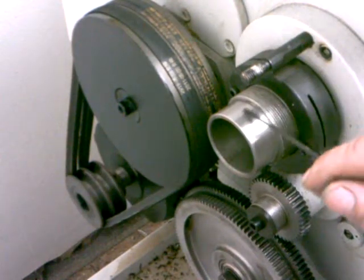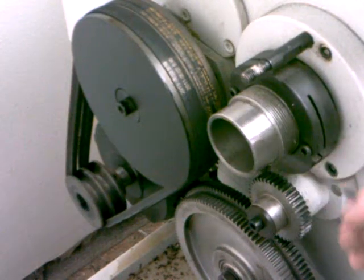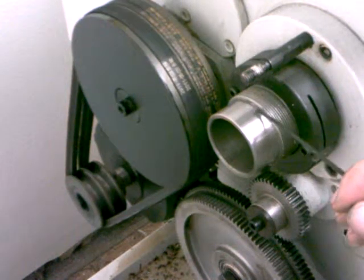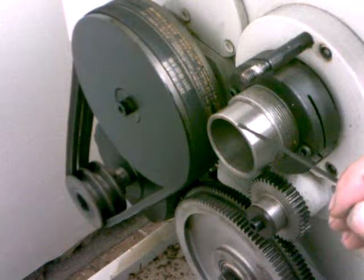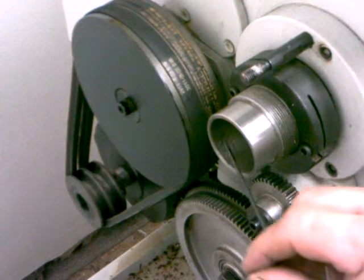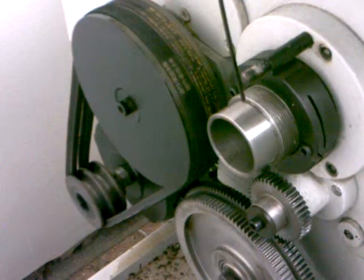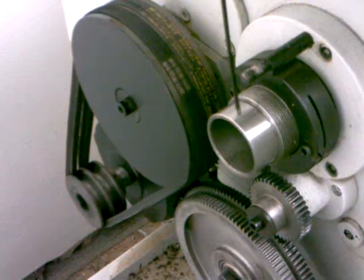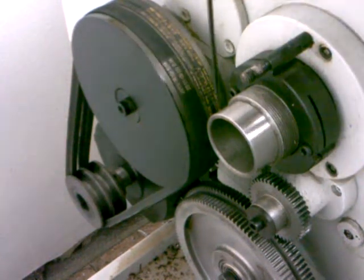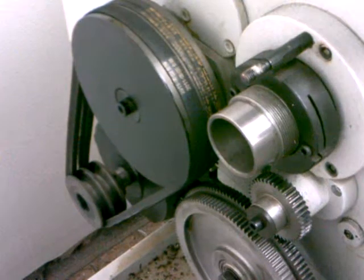Here's a look at the outboard end of my spindle. As you can see, it doesn't come out here very far — it just barely sticks outside of the guard that goes on here. The collar that I'm making is going to fit over the outside of this spindle and go all the way up to here. Right about at this point on the inside of that collar, there will be a step, and the rest of it out here will be the same diameter as the inside of my spindle bore. That collar — I'll drill an indention here for a set screw that will hold the collar onto the spindle, and then the collar will be drilled and tapped in four places for the brass tip set screws that will create the spider.